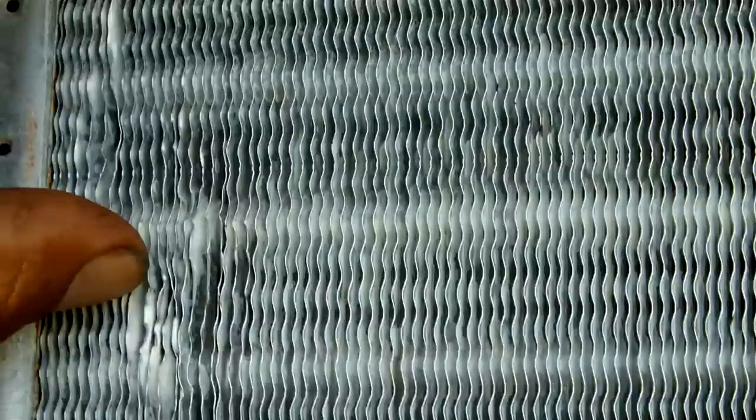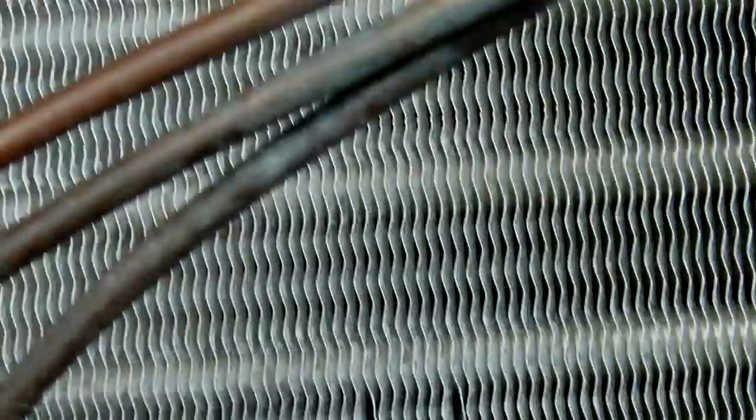So what that means is overcharge. All this is liquid all the way to the bottom. It could be overcharged, it could be a dirty filter, it could be a dirty coil in the back. Could be a dirty coil. So in the next video I'm going to explain to you the other part, like high superheat, how it works.